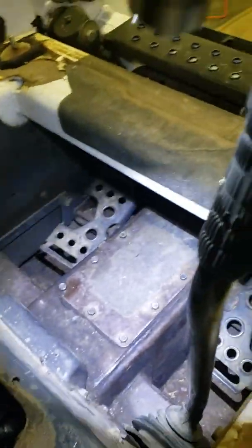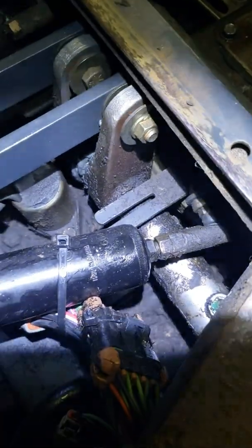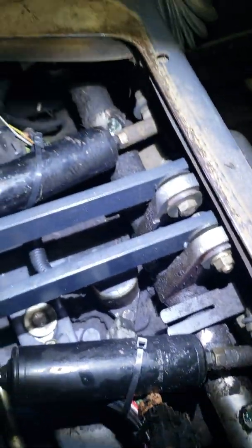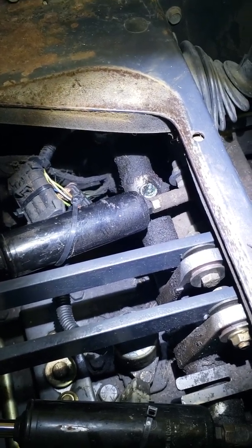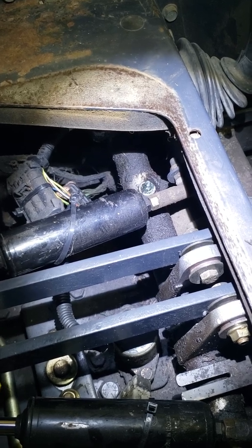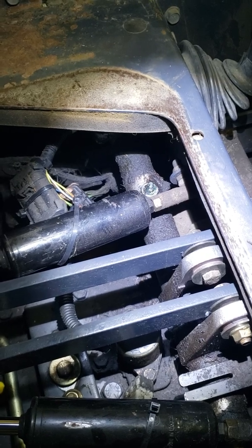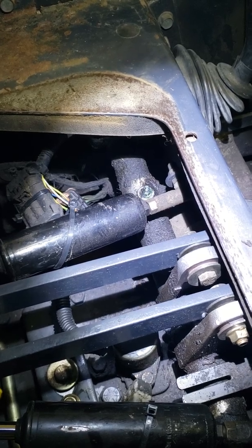Your drive arms — the arms for driving the machine — they move and sit on a pivot. Right there is a grease nipple on that pivot, and the same thing on the other side. You can see the green grease on there. Those are two pivot points that probably get missed by most people, as you don't lift the cab to normally grease the machine. Anytime you have a chance, flip up the cab and grease those nipples.